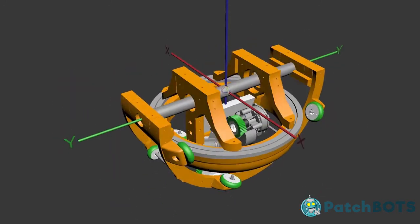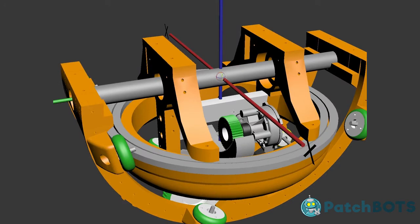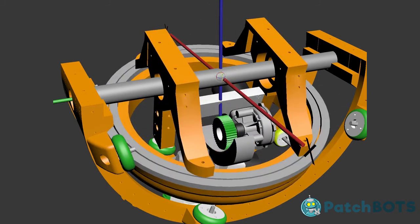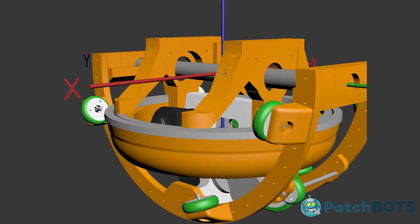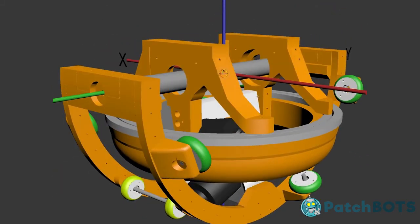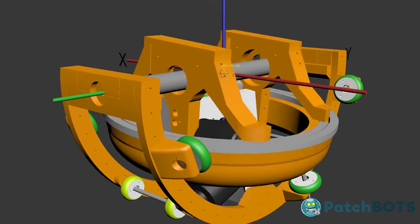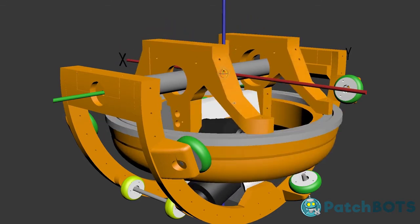Probably something about a giant, massive flywheel. So yeah, the flywheel here is going to be attached to the trousers. And then if we rotate those, you'll see that this entire mass is going to follow that track. Now this flywheel is going to weigh about, I have it at 15 pounds now, and if you include all the plastic and this big metal Lazy Susan I have on top of it, it's probably going to weigh around 18 pounds, and that's going to be swinging like crazy. So this is going to counteract any wobble that comes in from the wheel, and it's also going to steer.